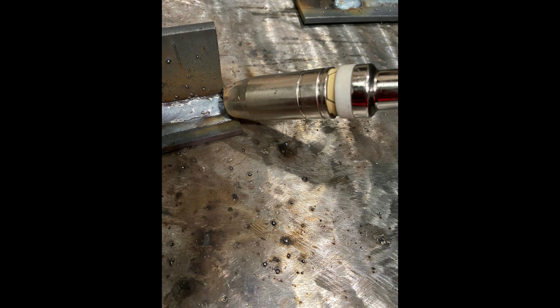To finish our final run, we drop our angle down to about 30 degrees. As we can see from the last run, the second pass has set us up really nicely, with the aim of covering half of the second run but also maintaining our height on the weld to ensure that our leg lengths are consistent.